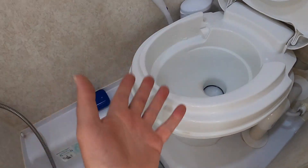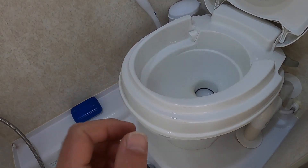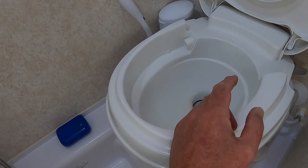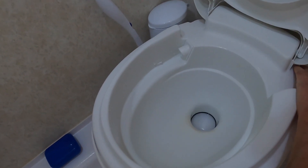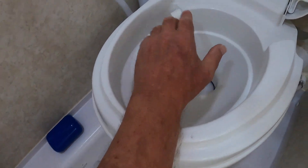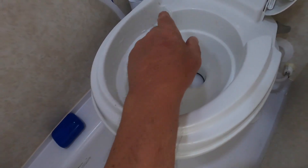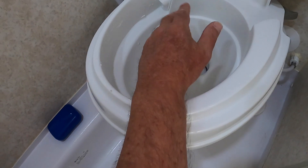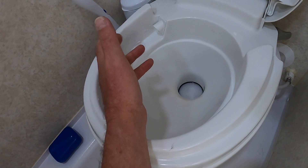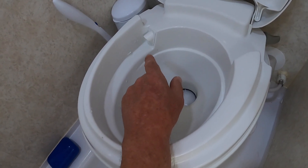What you're looking to do is sweep the water out of your lines — not just bubble it out, but sweep it out. So this is what a compressor that can generate about four cubic feet per minute does. I'm going to pull the toilet here and watch this. It blows a lot of air, and any water that's in there comes out. That's not because of extremely high pressure — it's at 45 psi — but due to the volume that compressor can produce.